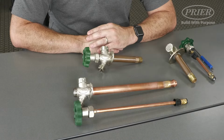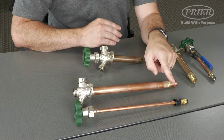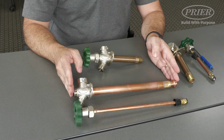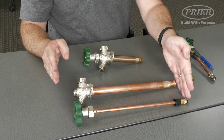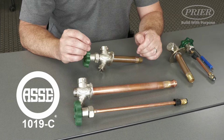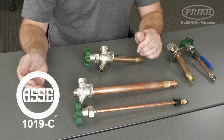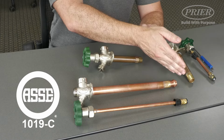Hello! This video is to address the orientation of the backflow preventer on your frostproof wall hydrant stem. Each frostproof wall hydrant has an operating rod that will connect the handle to the bib washer, closing the water off in the back. Per code, there must be a backflow check that is going to prevent water from the outside going back into the potable water system.